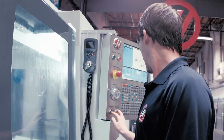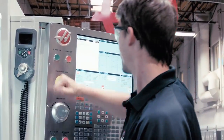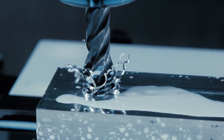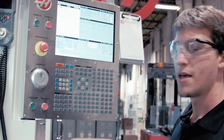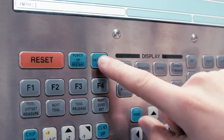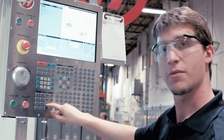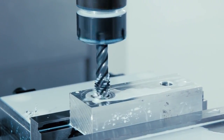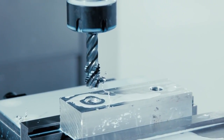Now here comes my e-stop — that tap is stuck. The first thing we're going to do is release our e-stop and hit reset. Then we're going to go to Recover and follow the on-screen instructions to remove the tap. We just hold counterclockwise and just like that, we're out.